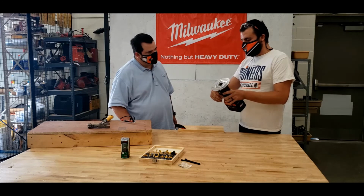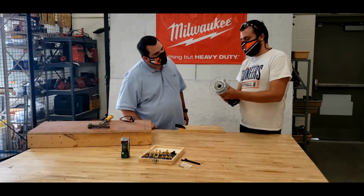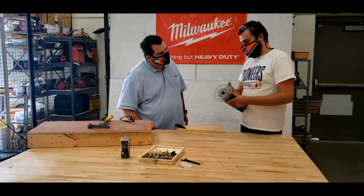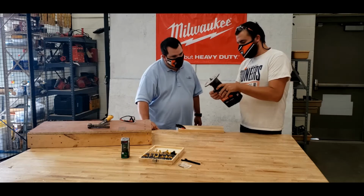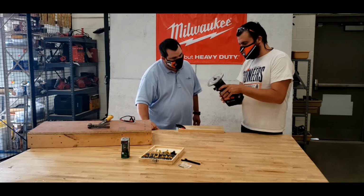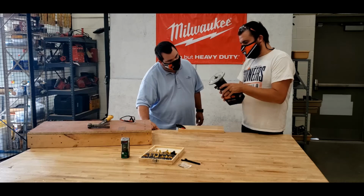This is how you adjust your depth. When you adjust your depth, you can loosen it. So this is macro. You can slide it up and down. Real easy this way, back and forth. When you get it locked in, all you do is flip this over and you're good to go. So when we set it, you can see this round over. We want the plate of it, this is called the base plate, to be right flush to that round over. Maybe a little bit extra, because you can always sand a little bit and you'll never know. So right there on the edge.